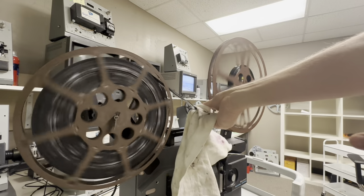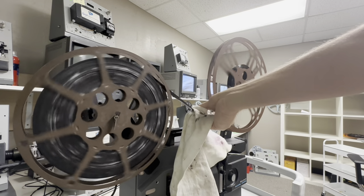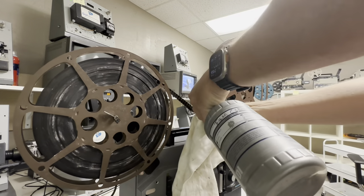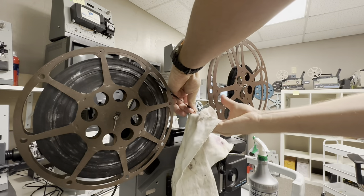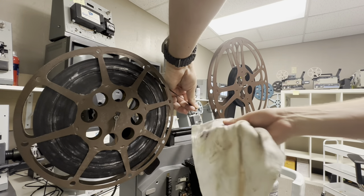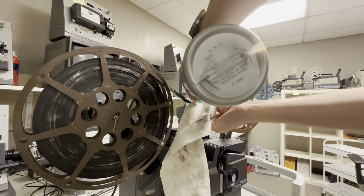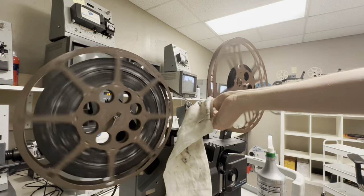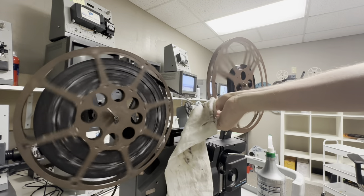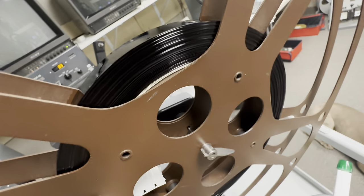It'll be all rewound and ready to go. The projector wants to go faster, but I'm putting a lot of pressure on the film itself and also applying the rag and turning it. Look at that — it's filthy again, so I'm gonna pinch it and douse this rag. It's soaking because this definitely needs it. Look — you can already see the difference. If I stop here, look at that — and then look at that, it's like shiny and new.